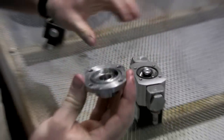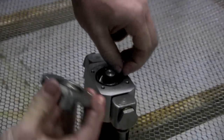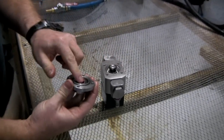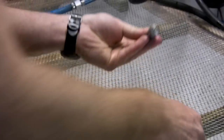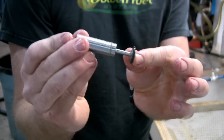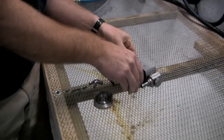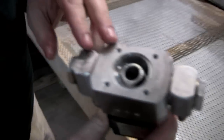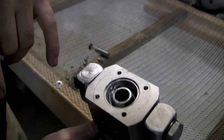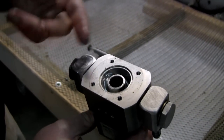Let's go ahead and take our industrial size valve here. As we look, we've got an O-ring — very similar design. An O-ring that sits in there. This plunger here sits around there and closes off the port. As we take this apart, we have a spring, a plunger, an O-ring, and a very familiar looking seal around the end of the plunger. Looking inside, a very similar thing is going to happen here. We've got a port with access to the center and an outer port, and as the thing is actuated, it shunts the fuel around.